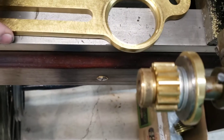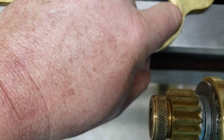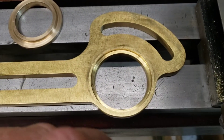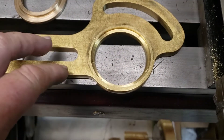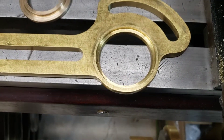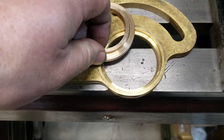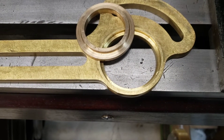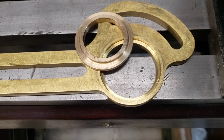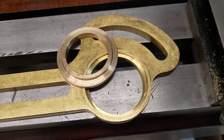The other problem with the banjo is it's shallower here than it is here, probably because it was bad when they bored this thing out. So I'm gonna need to first straighten this, and then I'm gonna need to cut some relief in the bore of this piece, and then that should have the banjo back where it will function properly. We'll see how that works out.